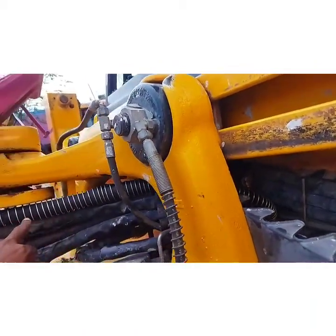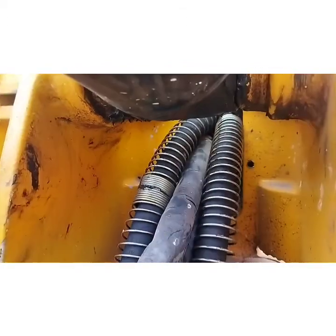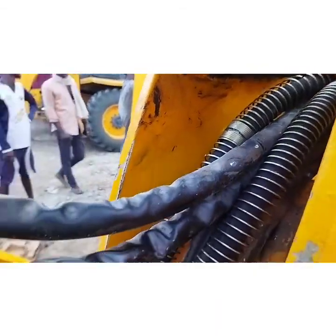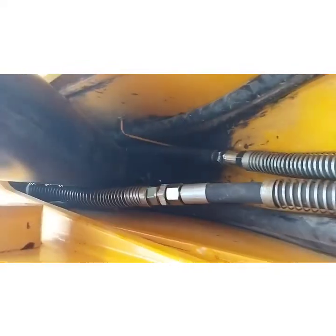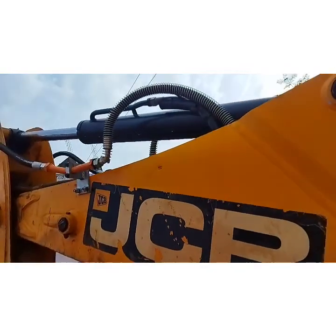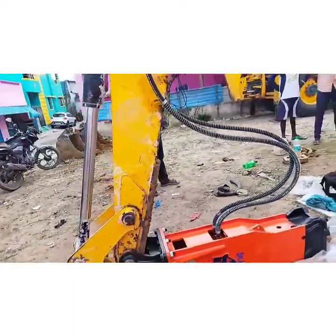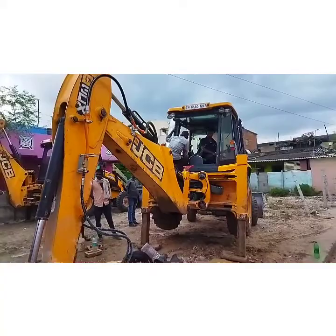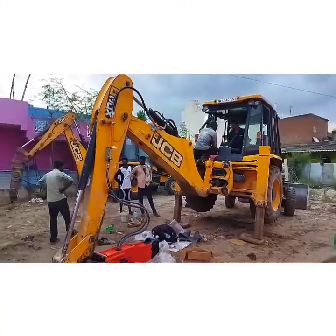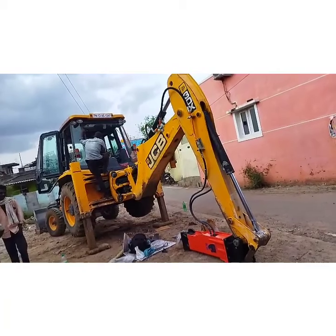This SKE 14 HD model breaker contains a piston size of 78mm in diameter at the top and 80mm in diameter at the bottom. The height of the breaker from the bucket main pin center to the bottom top plate edge is 50 inches. Compared to the breaker model DOSCO 430A, it is 4 inches lesser in height, so the total weight must also be lesser. Even though the breaker is of lesser weight, the piston diameter is slightly bigger at 78mm, so it would get higher force.